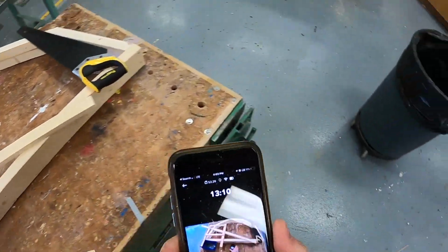Okay, so now I need four 12-inch pieces. And this time, 12 inches is short enough that I can use a bandsaw. When I'm using the bandsaw, I'm going to try and cut as exactly on the line as I possibly can. But again, I will, if I want to, cheat a little bit to this side, because I know that this length is 12 inches. So if I cut over here, I can sand down to that line. If you end up with more than a centimeter to sand down, don't take it to the sander. Just take it to the table band saw and you can trim it down. All right, so we'll be cutting four of these.